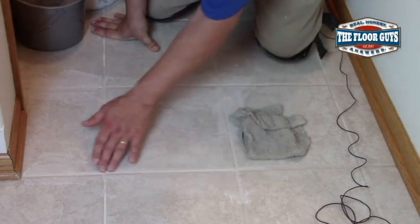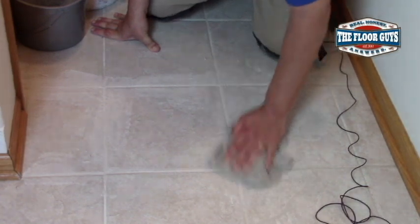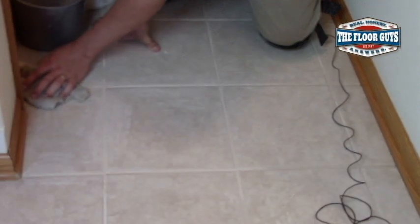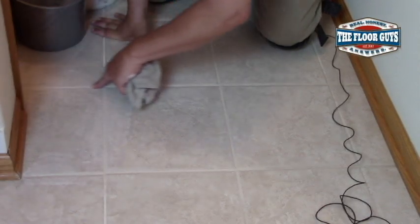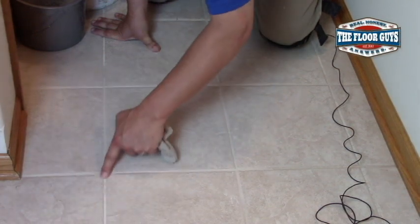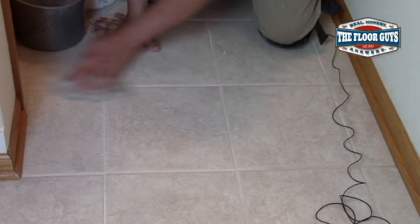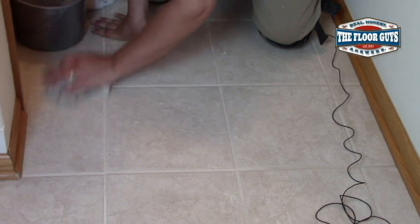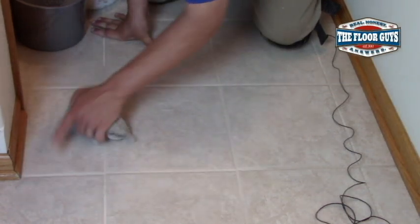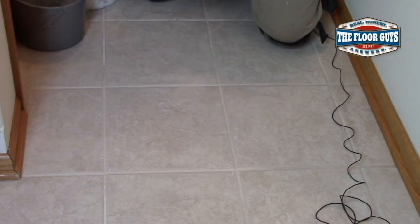We want to get the bulk of this off so it comes off nice and easy. I always smooth out the grout lines and make them nice and low, even with the others, with my fingers. Sometimes you take out too much and you've got to redo it — they're not a big deal. You just don't want to go over it too much, because you can just keep going and it will never be spot on. Just get it about like that. We're going to let it dry up even more and then come back and wipe it down one more time — you'll see a haze on it when we come back.